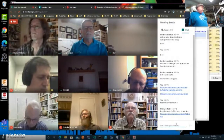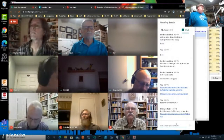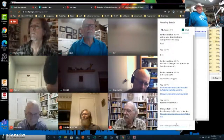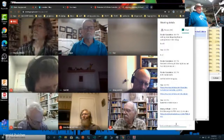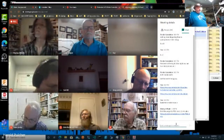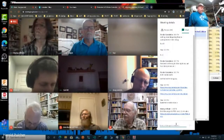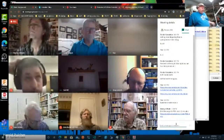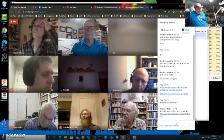One of the things I can do is stall the whole thing out and make it brown out, because I haven't supplied what they call a logic battery. There's a 5-volt input where, if you don't supply that, it'll take the voltage off the battery that you supplied for the wheels and give you a couple of volts to run all the logic. But if I give it 5 volts directly, then when I start trying to stall the wheels out, it won't brown out the logic. Currently it browns out when I do that because I haven't completely plugged all that stuff in.